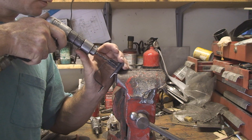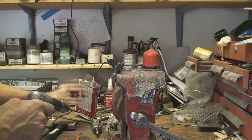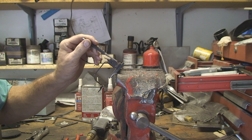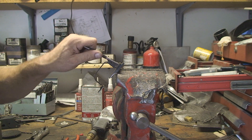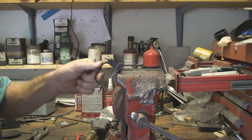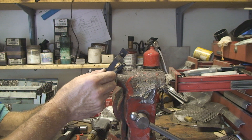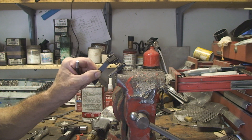You've got to be careful — a little bit of cutting fluid on the tip of the drill bit helps it out. I've drilled 25% of the way into the head of each rivet; it's through the head of the rivet but the depth is just below the trigger guard. I'm going to use my punch to just pop the heads of the rivets off. It's still locked on there pretty good — a few taps. There we go, that's all we want. I'll drill that rivet out and it'll be a quick swap onto the new receiver — easier than trying to make one of those rivets or install it.